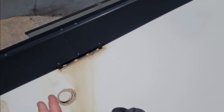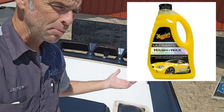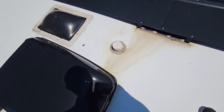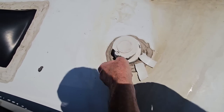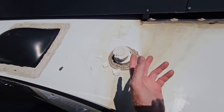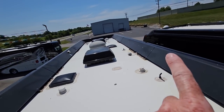The AC is dirty — this roof could probably use a good wash and wax. It is a fiberglass material and should be washed and waxed just like the sidewalls. A simple wash and wax is all I recommend; you don't have to do a ceramic coating or paste wax. Now if you've followed any of my Newmar roof inspections, you'll know that I talk about their sewer vent caps — they're kind of poor quality and not something they should be putting on an expensive luxury RV. These are like three dollars; a nicer one is like five. I could already see that one was going to fall apart.